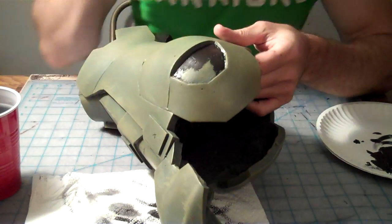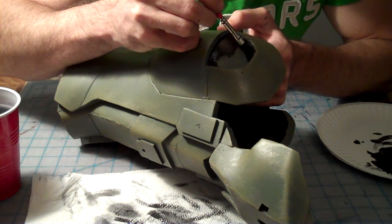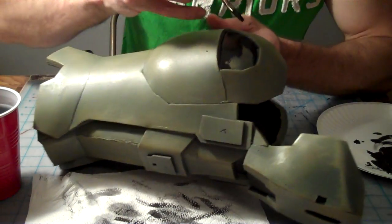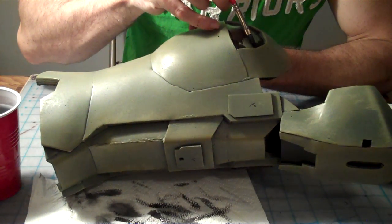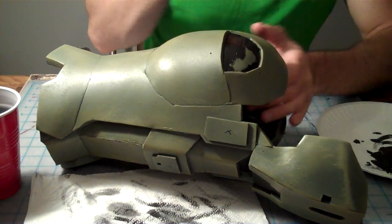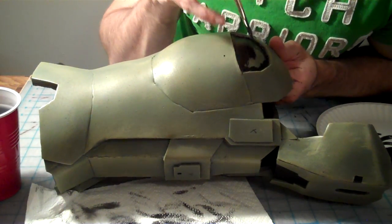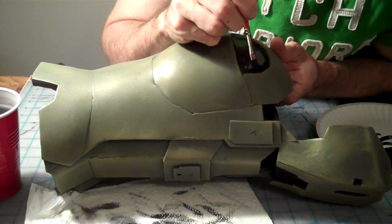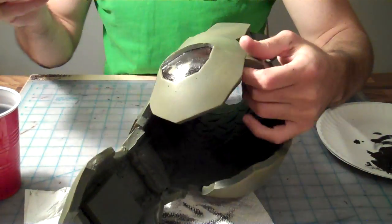A little hard to do this while trying to show the camera, but you guys kind of see what I am doing here — you get the gist. I am moving that paint right to that edge first, trying to be as exacting as possible, going to the edge, making sure that I fill in the edge as evenly as possible. I'm trying to keep the same line all the way around it, the same amount into that edge as I had from where I first started. So in doing that, because the brush is flat, I pretty much filled in all the middle anyway.